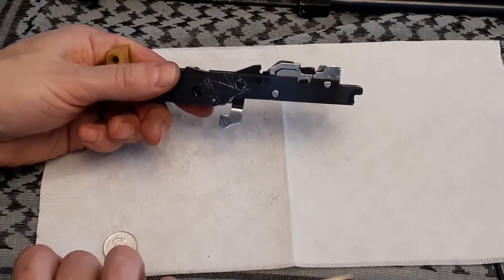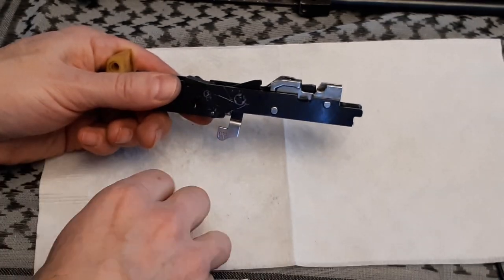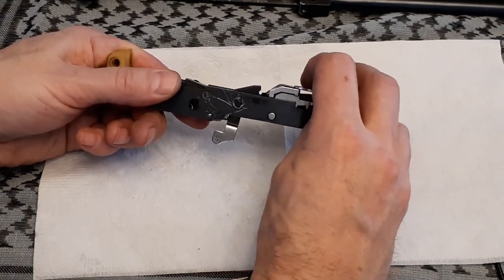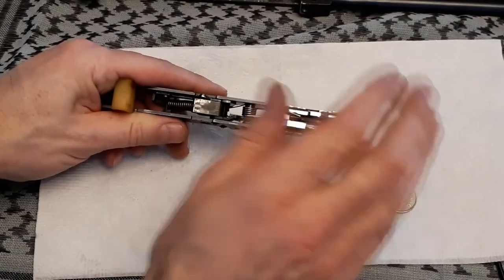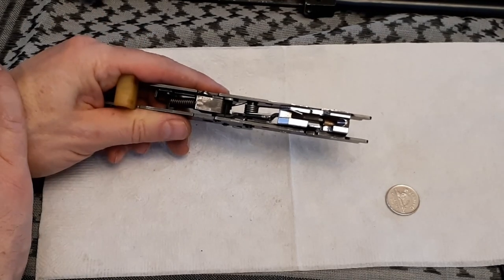Also when you view from the top, you want to make sure — although mine is very close to just laying on top — you also want to raise it about half the thickness of a nickel. Doing those two things has fixed all of my fail-to-eject problems.